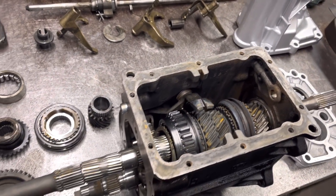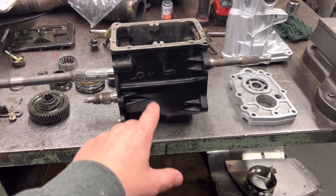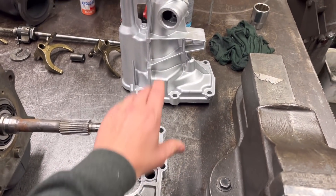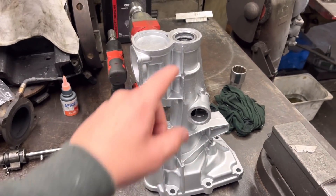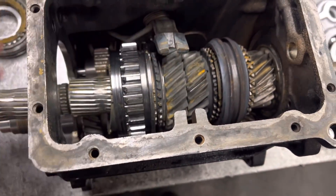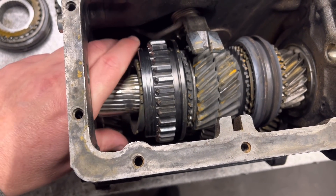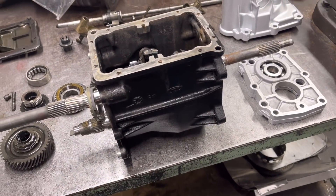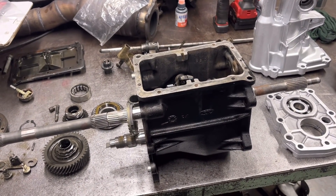So as you can see, we've taken all the gears out of the Type 9, we've got the bare casing, cleaned it all up and painted it. We've got the bearing carrier here which we've cleaned up and painted, and obviously the rear end of the gearbox we've cleaned up and painted too. We're just going to replace the seal and the bearings. We can confirm all the synchros are alright, so we'll just wait for the gasket set and bearings to turn up and then we'll assemble it — it'll look like a new gearbox. Thanks very much guys, thanks for watching — just a little update on what's happening in the workshop today. Remember to like and subscribe, and we'll see you in the next video.